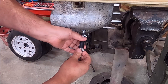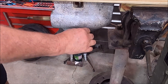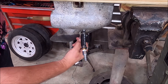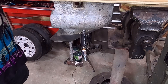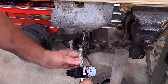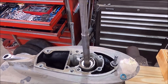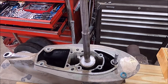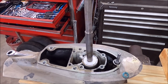I'll go ahead and thread that bolt in about four or five threads. Once it's up there, it doesn't have to be super tight — just snug, so tight the water runs out. Give it a little turn, and that should be locked in to the point where it's not going to leak. Now with the gauge set, I can just plug it right in. Take your soapy water and spray it around here — if this was leaking, you'd see bubbles boiling up under 10 pounds of pressure. Our drive shaft seal is good.